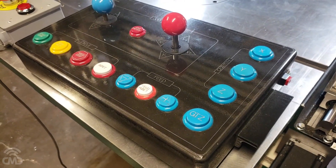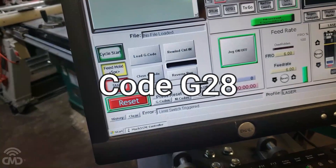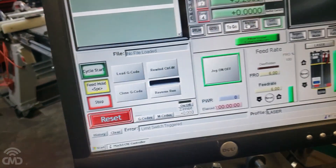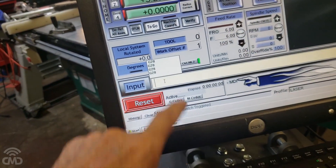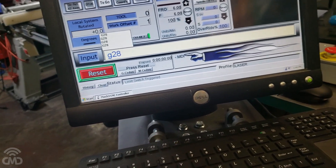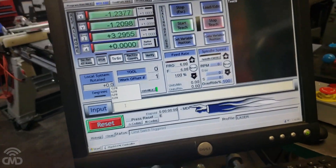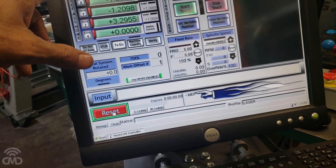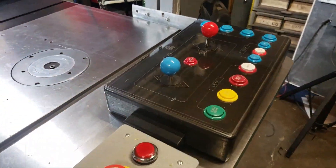This remote control works great — it's wireless — but it's missing a button. If I go to my zero position and want to go back to the zero machine coordinates, I have to come here and input the code G28, then press enter and it will come back to the zero machine coordinates. That's kind of inconvenient, so I want to be able to do that with a button that I can program the G28 code.